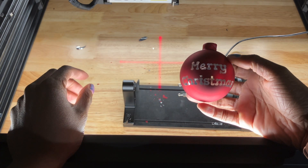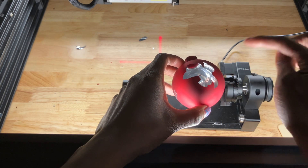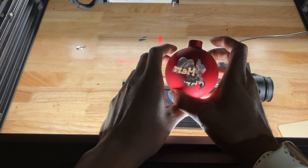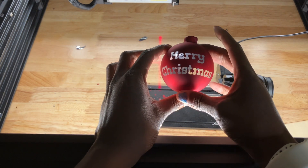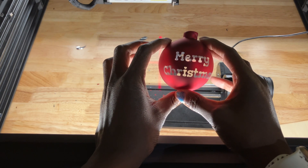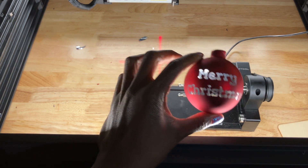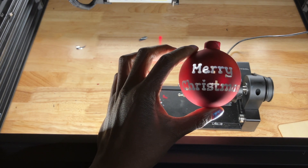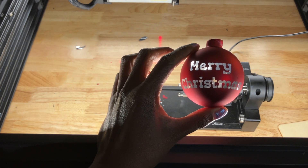Thanks for watching. I also just wanted to say — I tried to do that curve setting and it broke. It was telling me to measure on one side, then the other, and when it tried to measure one side it broke. You guys can see all the broken pieces in there. That's why I didn't do the curve setting in this video, but I will try it for another one I'm going to do shortly. This came out really amazing. This is a video just to show you guys how to get your settings specifically for your laser — just do a materials test array to find the best settings for you. I hope you guys enjoyed. Please rate, comment, and subscribe. Take care, stay blessed.